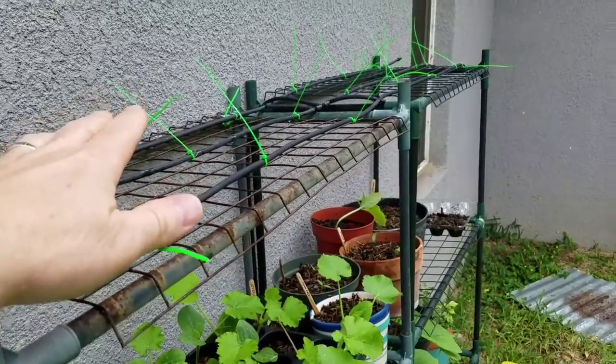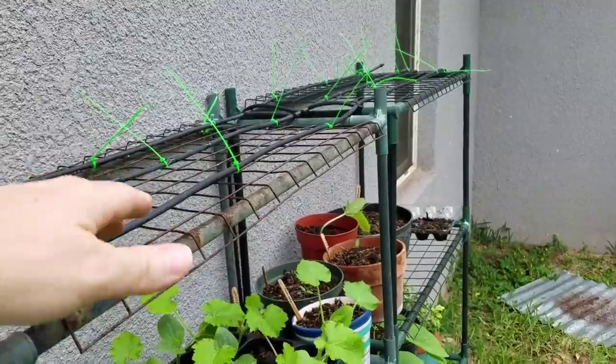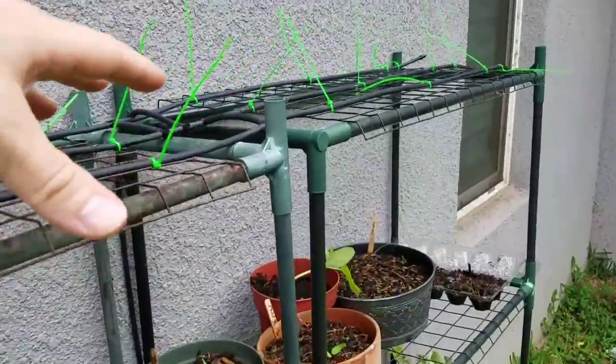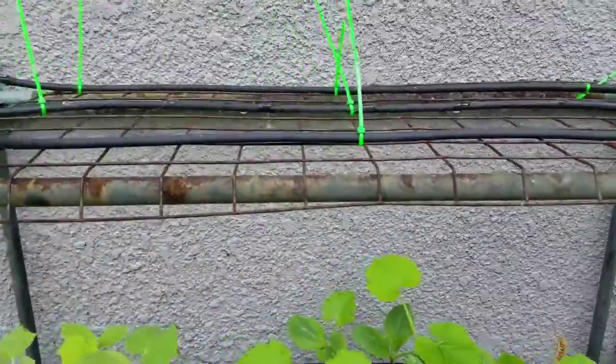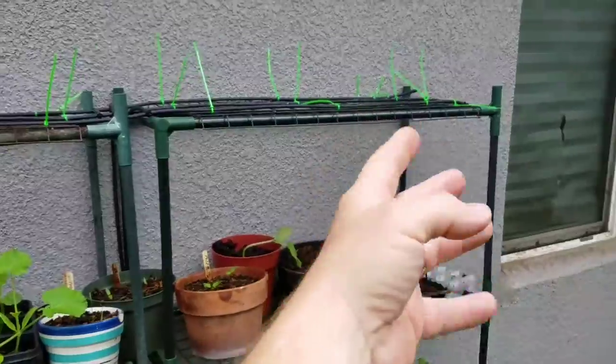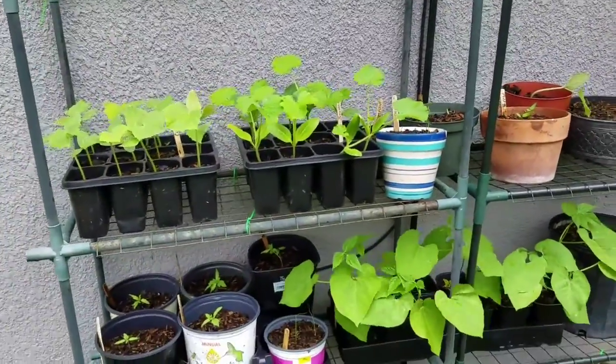Now you could probably make bigger holes down there or smaller holes down here, but you want equal distribution. You can't just turn up the water pressure, because then you get jets on this end and drips down there. So anyway, the drip system is working really well.